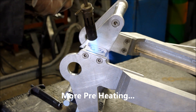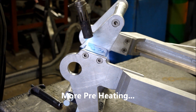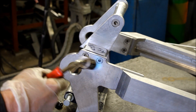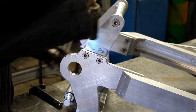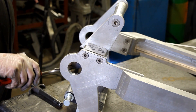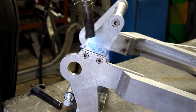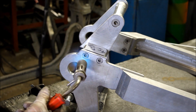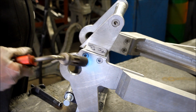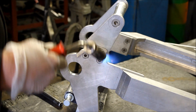Jeff is now preheating this particular area before he welds it. Jeff, what's the reason for doing a preheat? It's just so I can keep the range down on the amps - it's quite a big lump so you need less amperage when it's already hot. It's always better with a preheat on this sort of material. The problem is it's such a big lump of metal it takes a fair bit of heat to get going. We won't film the welding - we'll come back when it's done.